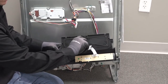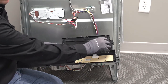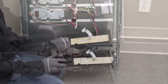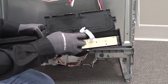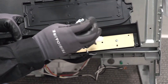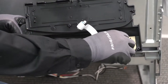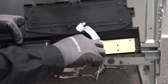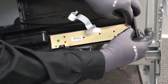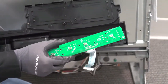There is a rubber gasket that goes around the perimeter of the control board cover - when that cover is in place it's actually sealing to prevent any moisture from gaining access into this area of the unit. The gasket lays up inside a little track, so make certain that you get it in the right spot when reassembling. For the user interface, there are three different Phillips head screws, and it's got a clip holding it on each side - release it and pop it off. That's our touchpad.